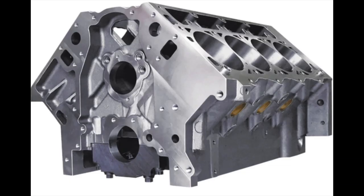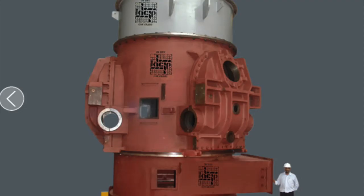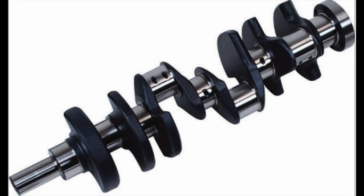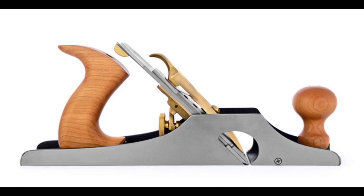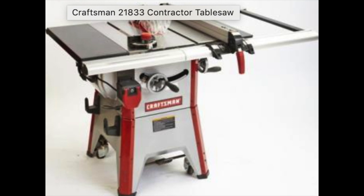Each has different properties and are good for different kinds of products — everything from coal pulverizers, to engine blocks, to pipe fittings. There are different grades of cast iron within each category, usually based on hardness, tensile strength, and compressive strength. There's not necessarily a bad grade of cast iron, because each has advantages for different applications.